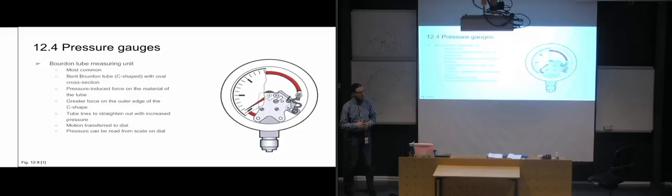And one thing that I know, if a Bourdon tube pressure gauge has been subjected to too much pressure, so it's been destroyed, it might not actually be visible to you. So you can't actually see that it's going to show you the incorrect amount of pressure, because it might spin several circles around there before you sort of get a reading on it, and then when it pops back down again, it might just look like it's slightly out of calibration, that it doesn't quite hit zero when it's supposed to hit zero.